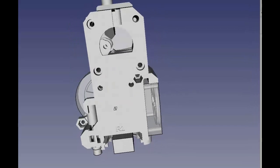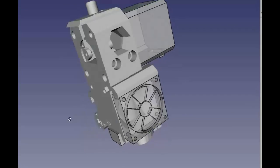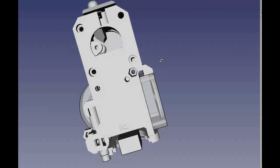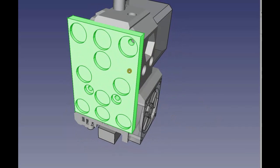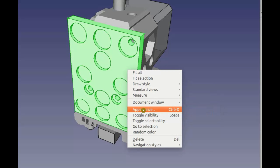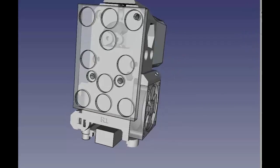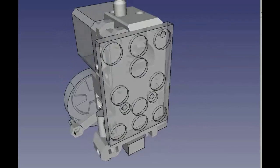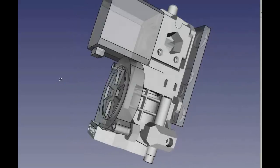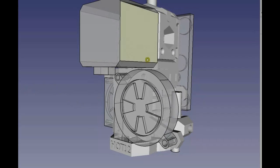Okay. And that way everything is accessible, this thing is buildable, and everything else. No conflicts? I don't think so. The extruder design incorporates some little holes for the motor wires and the fan wires. But as we use a different way to manage the wires, with that chain, I think we are not needing those holes. But that can be considered in the future design.